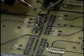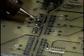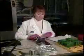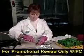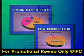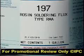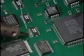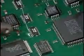This is very beneficial as part of a no-clean process, but it will make it more difficult to solder parts with poor solderability. This may result in the need for improved handling and storage of materials to ensure adequate solderability. The type and amount of activators are very important in determining if a flux can be used in a no-clean process. RA and some RMA fluxes typically use amine halide activators. These activators are very effective at removing oxides and improving wetting on parts with degraded solderability.